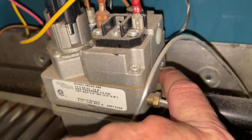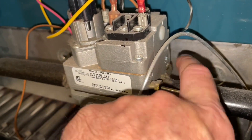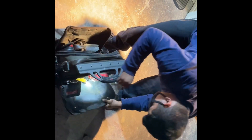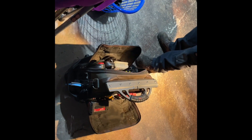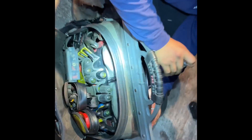We have a tapping port there and one there. Here is the inlet side. There's an Allen key — actually no, that's not there. It doesn't have one there. But we have one there and we can test our gas pressure there. So that's typical with Kelvin — we have our TruTech digital manometer but the tubing has been lost. The guys that work for me know that I'm very particular about my tools. Every tool has a certain position in my tool bag — the flat screwdriver goes there, the Phillips goes there. This doesn't even belong in here.